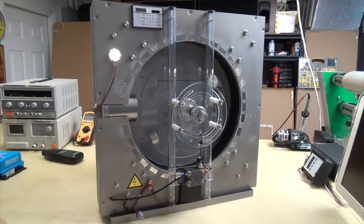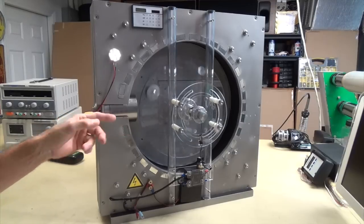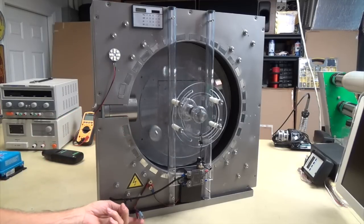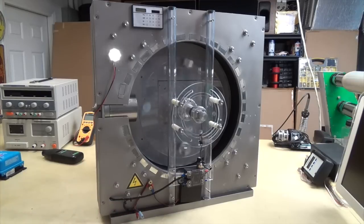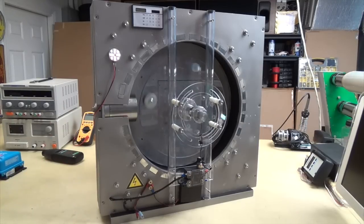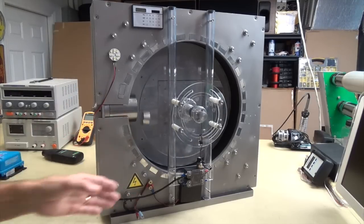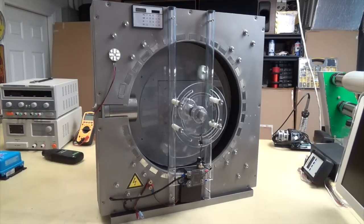And 40 volts will really run it, and you'll really get some nice output off of the collapsing field of this for your little spikes. Or actually, they're pretty big spikes. They charge up batteries pretty fast. And when you're running that fast, the 3-phase really jams out some power. I've got it set up to switch between delta and star, so you can get the voltage up to 50, 60 volts or down to maybe 24 or something like that. Okay, you can see that it's going very, very slow, but it is accelerating, and it will more and more as it goes.